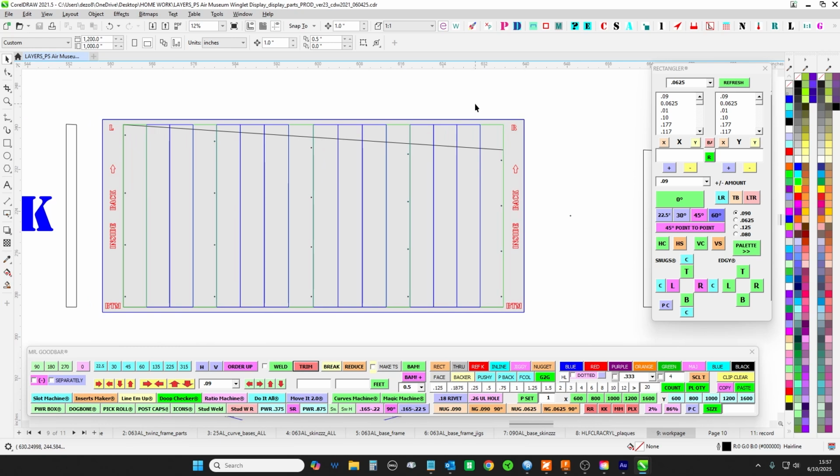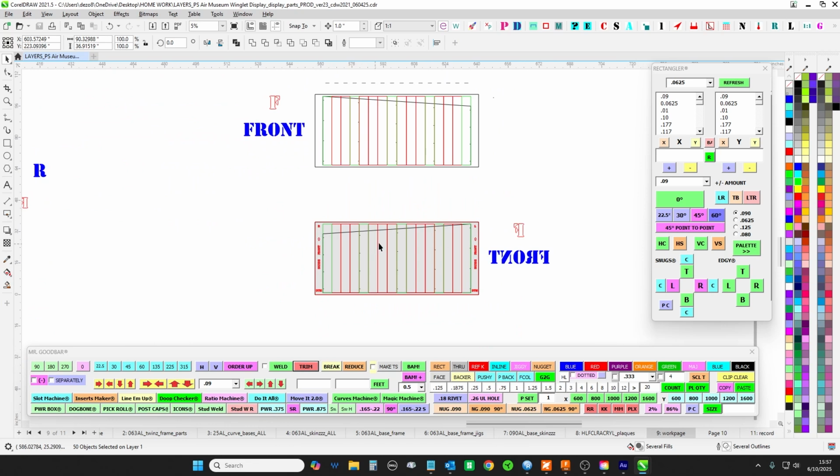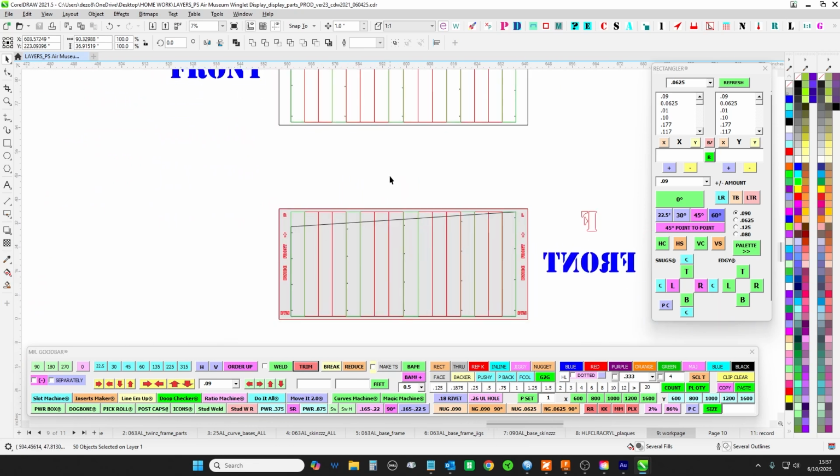Because if I were to give you a tapered piece, the pressure of the metal would change. So to start here, you get a different bend because of pressure squish by the time you get here. So I did it on purpose. I gave you a square, rectangle, but square piece. That way, when you run it through, it will be the same pressure and you can get the same curve. Then what you're going to do is run it through one way, flip it, run it through the other, so that way it's kind of even.